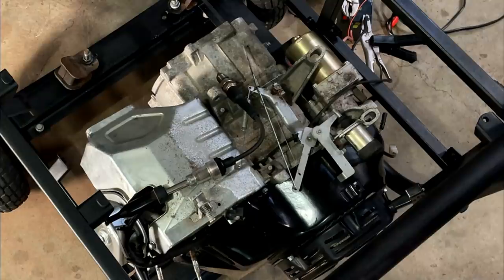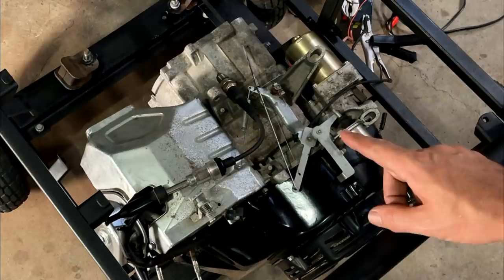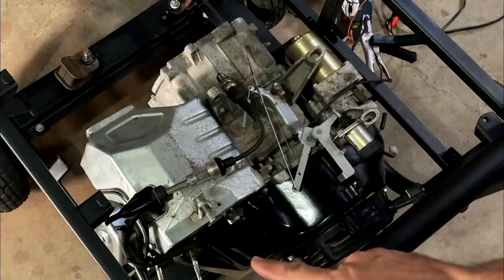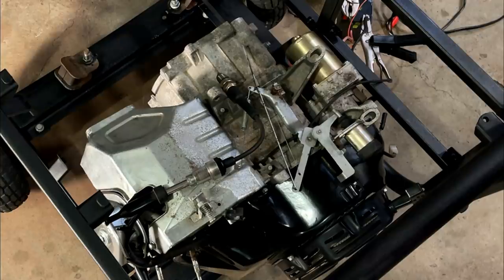All right, well, there's your problem. That light was barely lighting up, and I only saw intermittent spark on the spark plug. So, yeah, that's not going to work. And this is at atmospheric pressure. Once you put that plug in and it tries to spark under compression, you need more voltage than you would in normal atmosphere like this. So chances are it's performing even worse when installed. So I think we need a new coil.